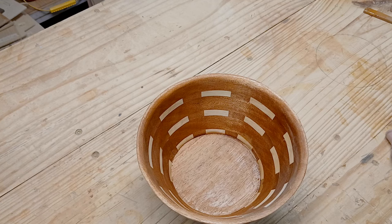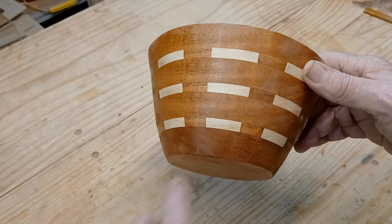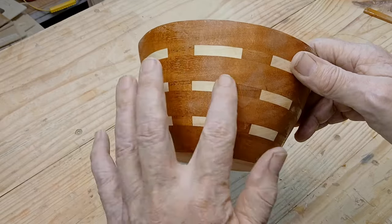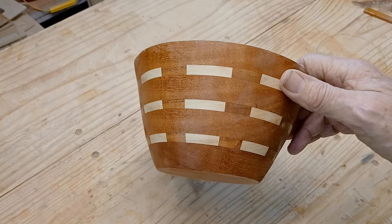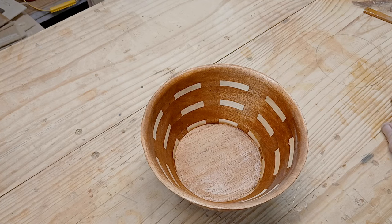I'll probably put another short video out this week to kind of make up for this one being short with no bowl making. I hope you like the way the bowl looks. Sorry I didn't get to show you how it was made — it's a multiple-angle bowl. Each segment was cut twice: first at an angle to match the inside angle, and then cut again to match the angle on the next ring down. It sounds complex — I'll demonstrate that the next time I do this.